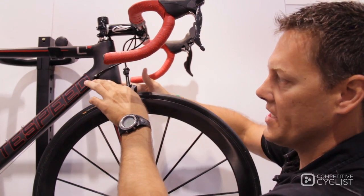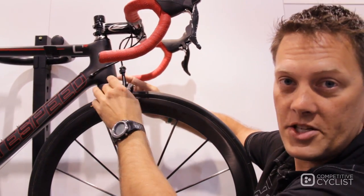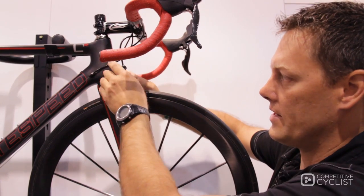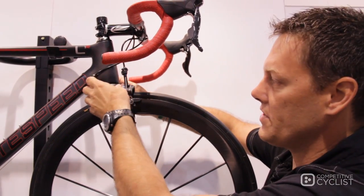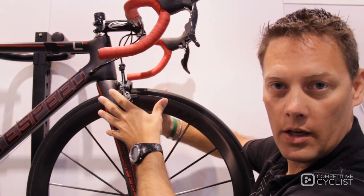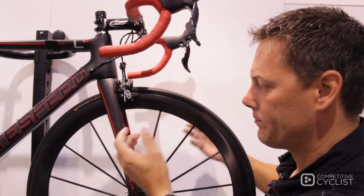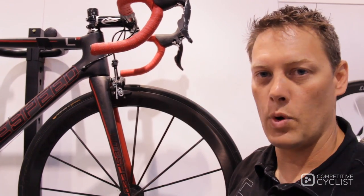Mating that head tube — 62 millimeters at the bottom of the head tube — right into a big 62 millimeter crown. That oversized junction gives us more stiffness, smoother transition, no bowing of the fibers, and a very linear design. Just straightforward stiffness to weight.